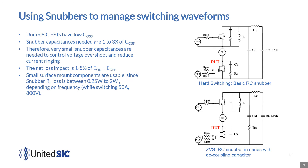United Silicon Carbide's normally on JFET technology has very low specific on resistance and resultantly smaller die size. This, along with their device architecture, leads to very low CDS and COSS. This allows the use of very small snubber capacitors to effectively manage switching waveforms, controlling voltage overshoot and reducing current ringing even when using relatively high inductance packages like the TO247. With small RC snubbers, the net loss impact added by the snubber is very small, with one to five percent typical depending on the operating conditions. This small loss — say a quarter watt to two watts — is manageable with surface mount components, even when switching 800 volts and 50 amps.